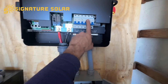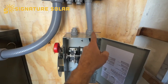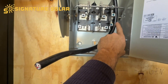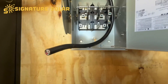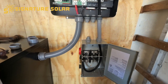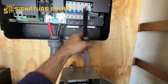Got one in. For now I'm just going to leave the wire like this — I pulled it up so I have a little bit of extra past where it would be going into the breaker. And this one, which will be generator, I got going all the way down and it'll be connecting to the two hot and the neutral, with the ground over there. Take your time with all this bending — I've got all the conduit sitting out in the sun so it'll be a little more malleable. I'm pulling the wire past where I'm going to need it so I have a little extra once I pull the sheathing back.